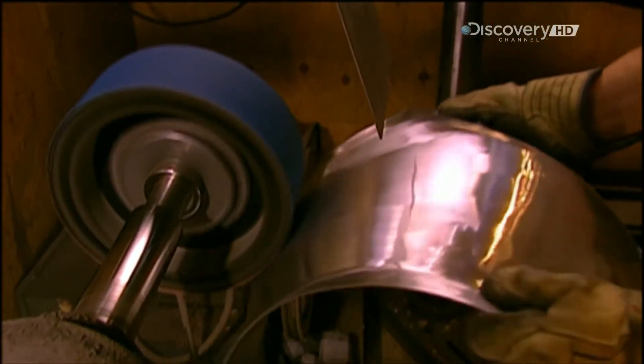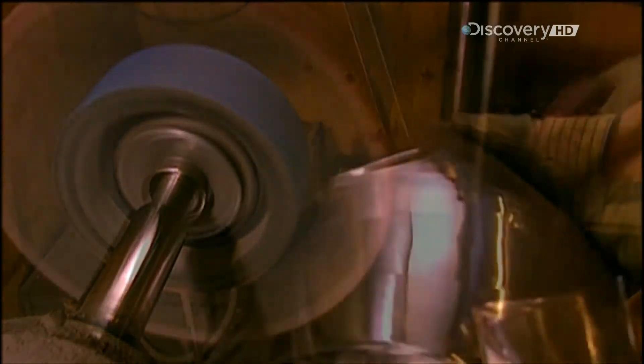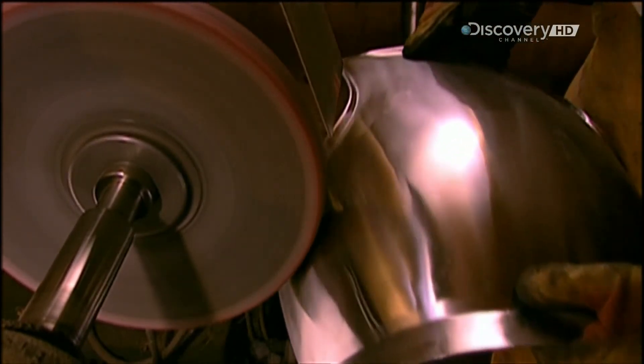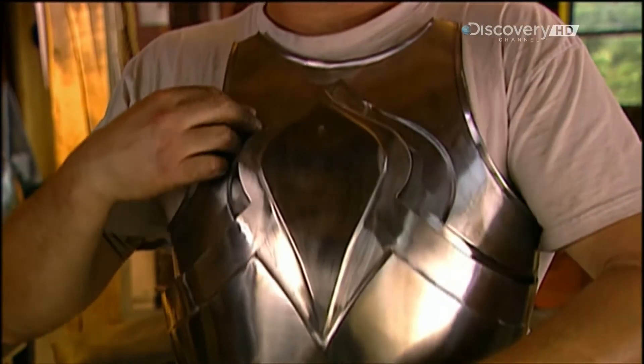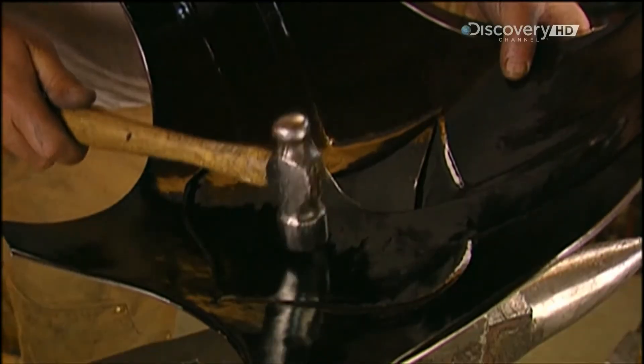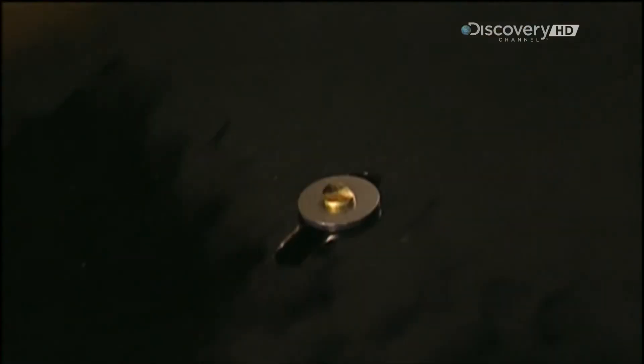Then with fine grit sandpaper. Then the last step, with fine grit paper and a polishing compound. Some breastplates have an articulated styling. For this model, the armourer uses three brass rivets to attach the sections, fastening them loosely to enable the pieces to move.